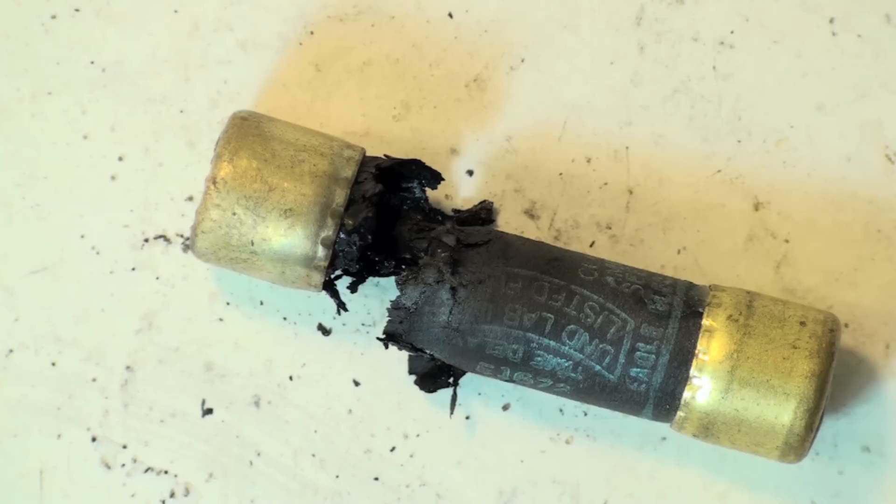Generally with a disconnect, if you've got a bad connection you can try to clean up the clamps, but it really won't make much difference. The clamps are made of spring copper, and once they've been heated up too much, the spring copper does not work anymore — it won't hold tight.